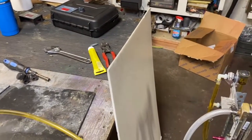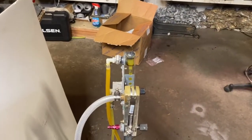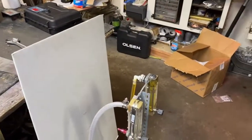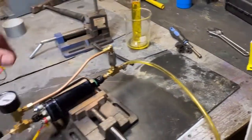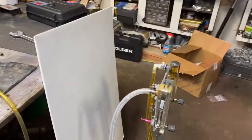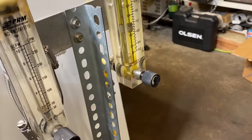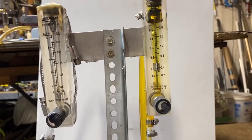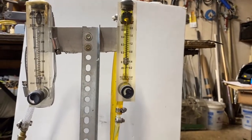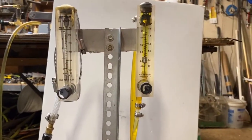To achieve that I'm just going to open this bypass valve about halfway to start so I don't overpressure anything. Getting your fuel system primed is going to be kind of a pain in the neck but you've got to do it. I've got the bypass valve fully open — I'm going to close this valve to bring the power down. When you start off you're not going to have all burners going at one time, so this is going to pressure up on you a little bit, so make sure all your hoses are nice and tight. This thing can do about 45 PSI.